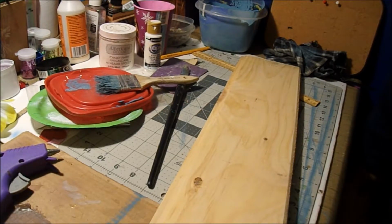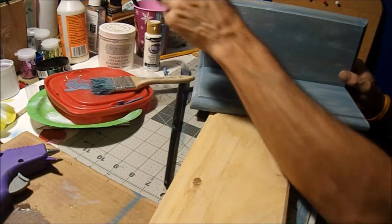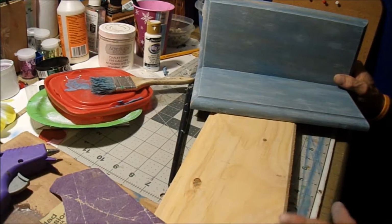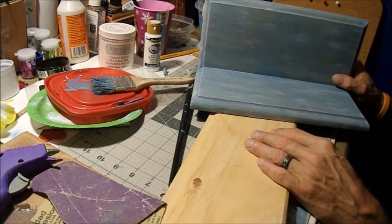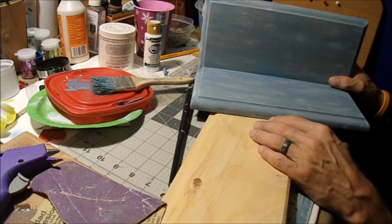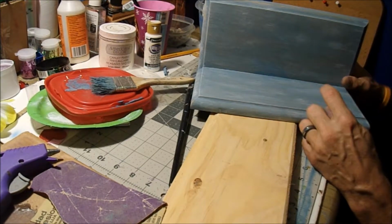And then you just antique it afterwards with your white, blue, black. I mean, you can do all different colors. And just like I said, hit it with the sandpaper around your edges, everywhere that it's just sticking up, and that'll take that little bit of paint off and give you that distressed look. I was antiquing them before, just distressing them, but leaving the different colors fade through, the thinner your paint is, and that nice chalky paint.